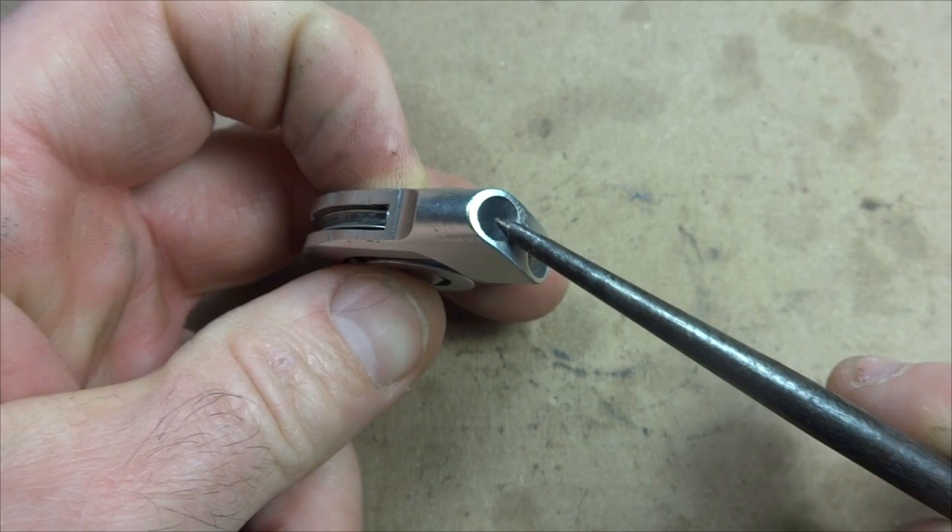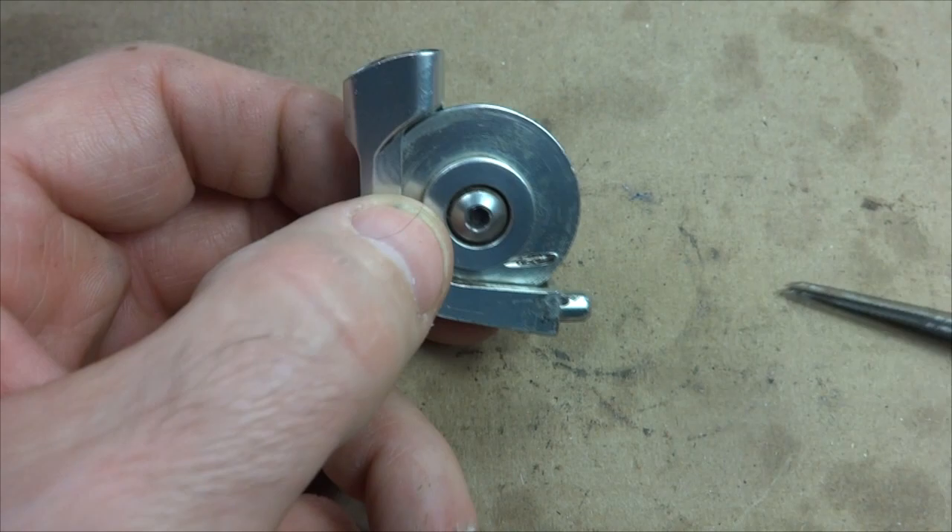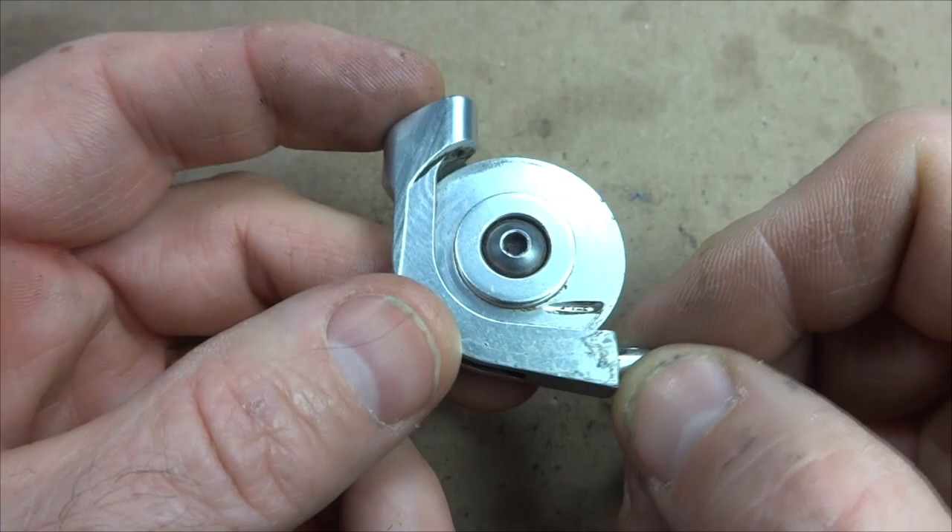This could also be used as a simple little pulley — if the cable comes in through here, it just goes around here and doesn't increase pull at all, but it allows smoother operation around a tight bend than a noodle would. And on V-brakes, this basically replaces the noodle.